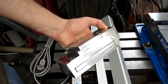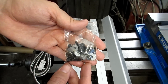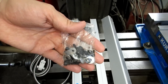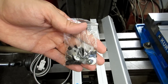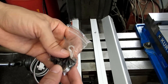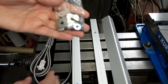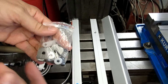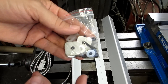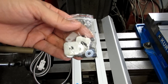You can also just throw them away and make your own. The kit also comes with a bag of fasteners for each scale, and it's everything that you're going to need to connect everything together. In my case I live in the US, so I'm probably going to switch out to inch fasteners where I can, because I have a lot more inch taps. You also have these cable clamps that you'll use for cable management later on, and most importantly you've got these shims. Since you're attaching this bracket to a casting, that casting is not going to be perfectly flat, so you use the shims to correct the in-and-out or side-to-side location of that bracket to make sure it's square to the travel of the table.